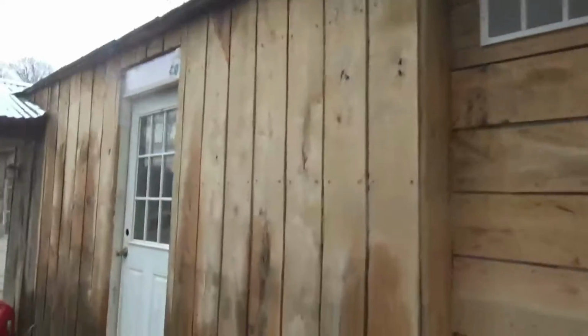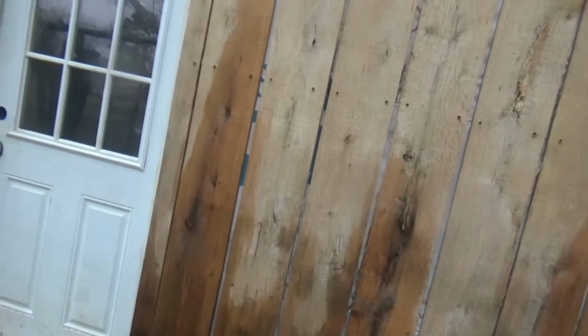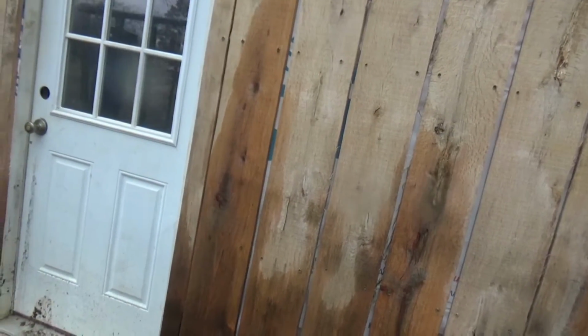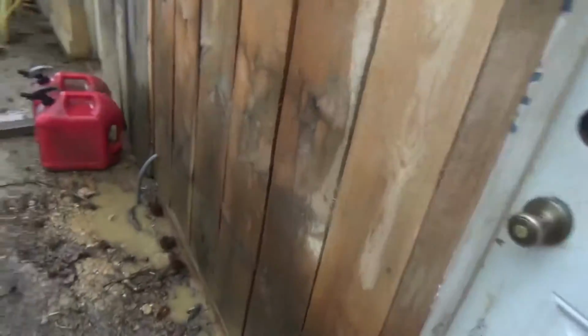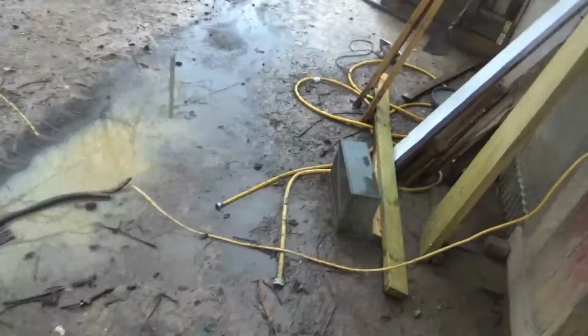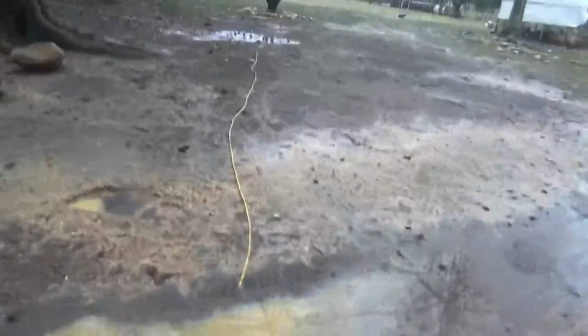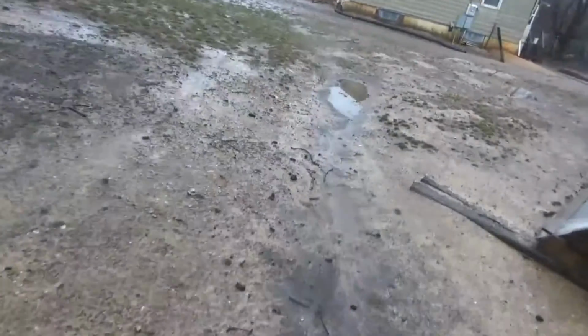An example of that would be catching that water off that roof, filtering it, and running it through a toilet only. You don't have to drink with it. It's a big enough tank where it never goes empty. You don't have to pump water in it. You can just use rainwater to flush. So you're holding it up, using it to go to the bathroom, and then flushing it into your septic. Or if the water is clean enough to use for a shower, then you use it to wash, and then you put it in your gray water and put it in your garden. Hold your water uphill and use it as many times as you can without pumps and all that.